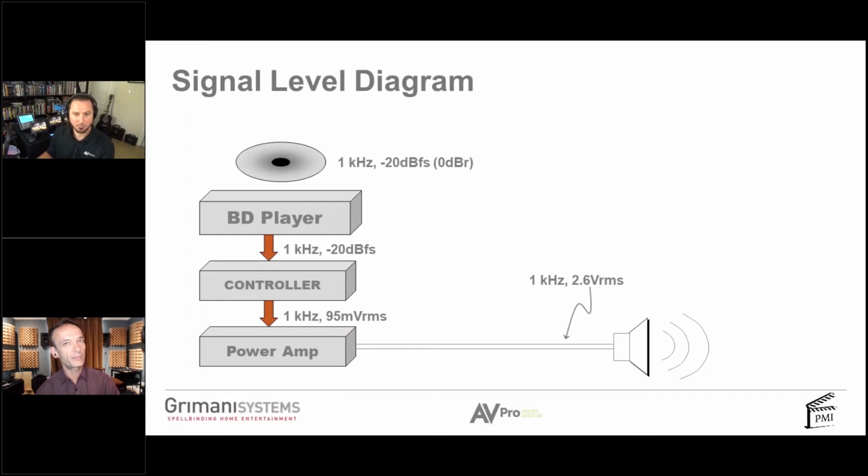If you have a proper power amplifier with an output impedance of 0.01 ohms for a decent amplifier, and a speaker with an impedance of 4 ohms, it doesn't matter where you hook it up. There should be very little change. If there is a change, you've got a problem with either the amplifier, or the speaker wire going to the amplifier is way too thin and way too long and has become resistive. So you could actually try that: disconnect the speaker and reconnect the speaker. And if you see a change in that, something's wrong.